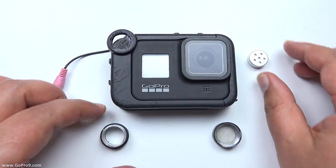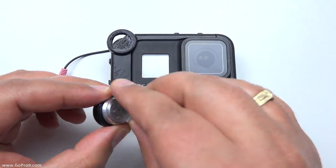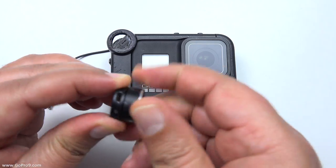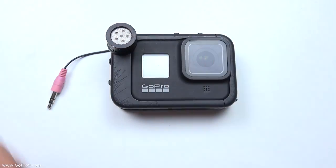Now as you'll have noticed, the whole thing looks like one big heap of mess. Well, if I'd done this particular mod in the first instance, it would have looked really neat, because the messiest part of the earlier mod was the front. I mangled the front and took the grill off in order to put a little extension piece on the front so I could put cardioid capsules in. Because cardioid capsules need space behind them in order to work properly as a cardioid. An omni, on the other hand, doesn't. So if I'd done this one in the first instance, that front piece wouldn't have been a mad mess, it would have been dead neat.